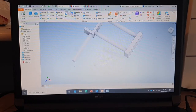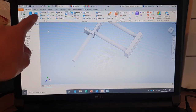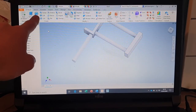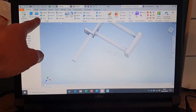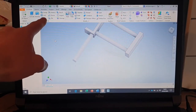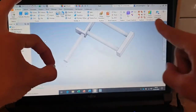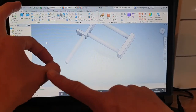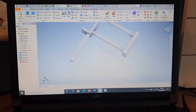But two of the things you need to learn how to use really to make shapes, you've got essentially making 3D objects here. You've got extrusions, which we've done, 5 steps. You've got a revolution, which is the same 5 steps, but you need a center axis to revolve it around. Lots of tutorials on YouTube. You've got a sweep tool, which is what I'm going to give a go now. And you've got a loft tool. A loft tool, you can draw 2 shapes like that opposite one another, and it will just simply join between the 2 parts. A sweep tool, I would draw 1 shape and a line coming out of it, and then the shape will follow that line. All right, so let's try that.